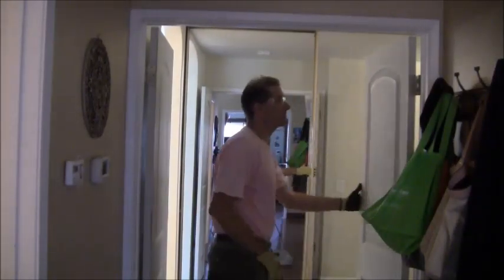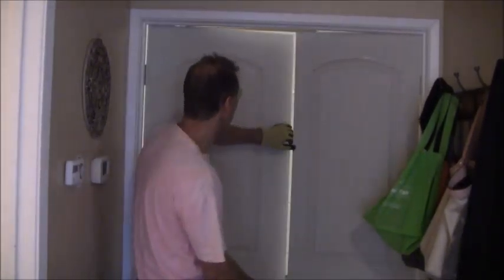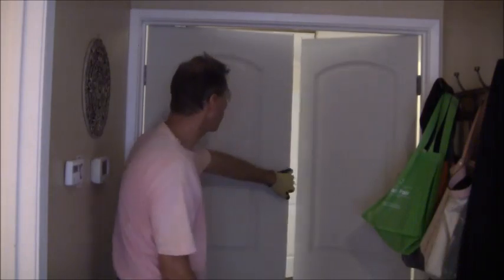And then after I did all that and I got the doors like this, I go ahead and just do a dry fit. Just make sure that nothing came out of adjustment while I was messing with the hinges. Make sure that everything closes properly. I did it just a second ago. Everything's good. So I don't have any issues with the doors. So now I'm going to take them off the hinges, take them upstairs so I can cut in the lock set and also fix those two hinges on just that center.